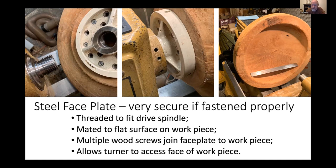On the face plate: you can see the female thread on the face plate and the male thread on the spindle. The face plate mounts on the spindle, and note that the bottom of the work piece should be very flat — what you don't want to do is try to hold onto a rumpley surface with a face plate, because you'll get inevitable vibration. When you get vibration, you get fatiguing wood and fatiguing metal — and there goes the flying kindling again. The advantage of the face plate is that it allows you to work across the front of a bowl, and you have access to get across the front.